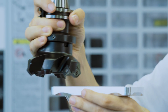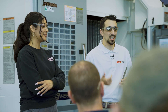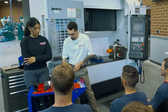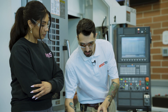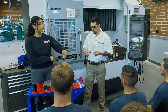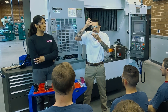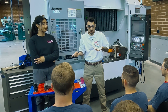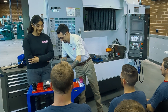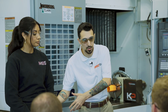There are three common drills in my experience as a CNC machinist: high speed steel, which I don't use anymore; carbide drills; and three-flute drills — we call them twister drills — which I use a lot for aluminum. The big advantage of moving from high speed steel to carbide is you can use through-spindle coolant, which blasts coolant right through the tip of the drill. Instead of peck drilling, you can use a G81 canned cycle with a carbide through-spindle coolant drill and just run it straight through — it throws chips like crazy in any material, not just aluminum.